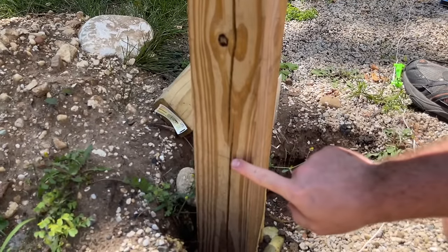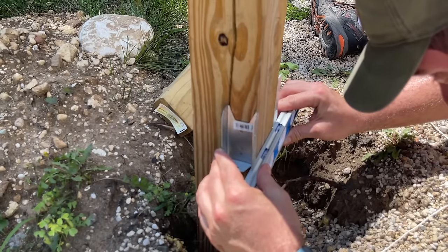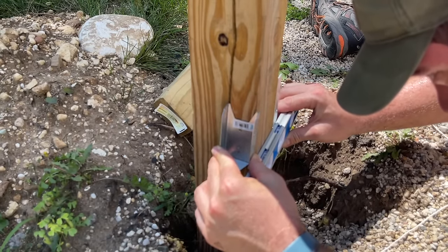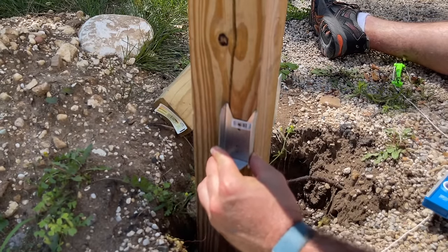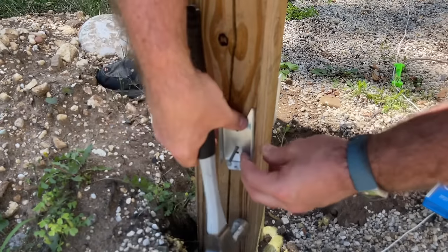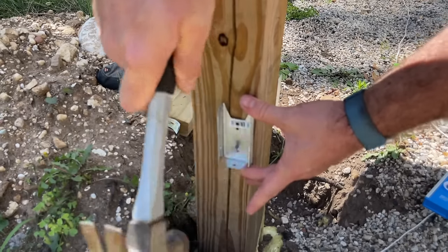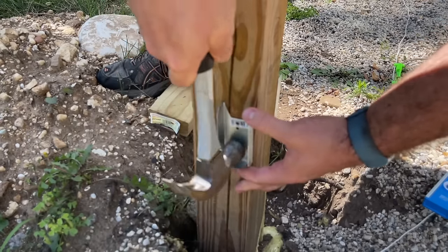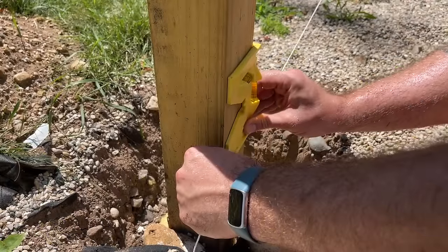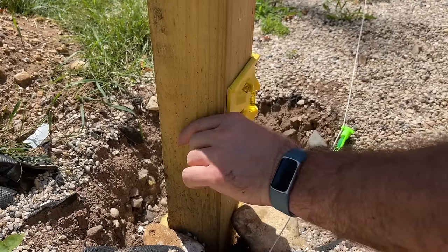When we did our original line, we did run it all the way around. We use that same bottom line for each next bracket, but verify with a level to make sure it's even across the board. I also started making lines at the top of each bracket so I know exactly where it's supposed to go — since I'm coming in from a different angle I can match the top line and make sure it goes in the right spot every time. I'll use this same procedure for all 18 posts all the way around the fence line.